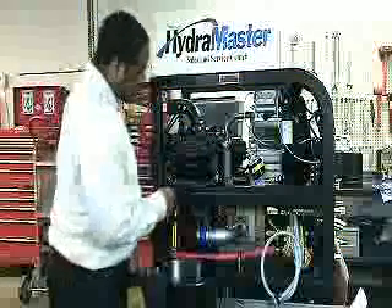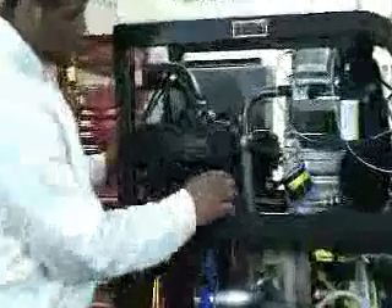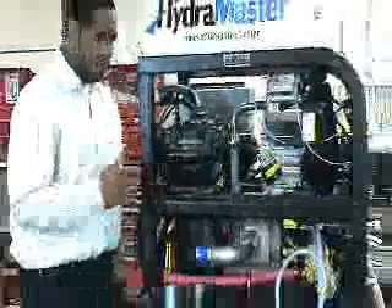The blower oil needs to be inspected daily, preferably before use, by looking on the side of the machine. You will notice two oil sight glasses on the side of the blower. They should be filled to about three quarters of the way, so if they're below that, add as needed before using the machine.